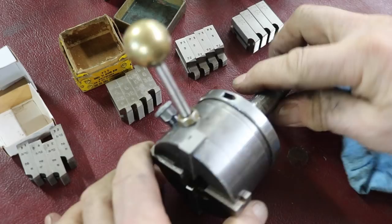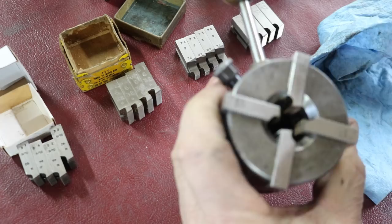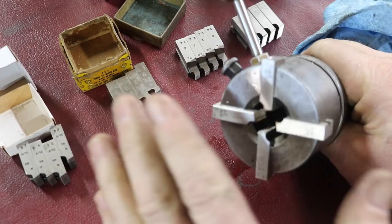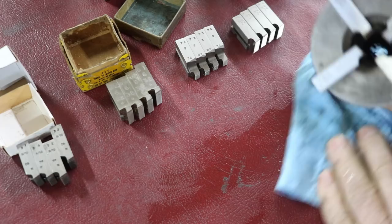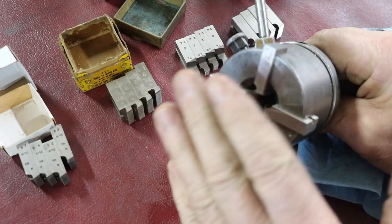This is about 3 inches across, and this has a set of die chasers in it. Now they're called chasers. Now this type of chaser is called a milled chaser. And then there's tap chasers, and then there's tangential chasers. I'll go through some of that real quick, but there's different kinds. These are milled chasers, this style.